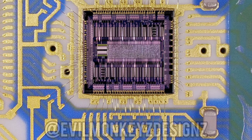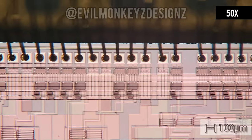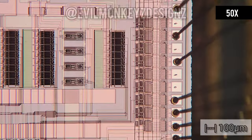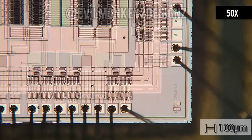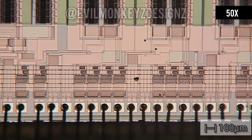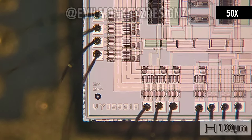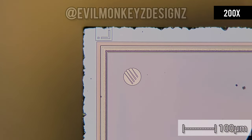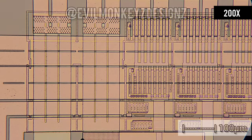This second chip appears to be made by VLSI and includes the text MUDAC in one of the corners. In the context of an integrated circuit, I think DAC refers to the fact that this is a digital to analog converter, with MU being the Greek letter mu — the common symbol for micro — or perhaps I'm reading too much into the name MUDAC. The part number VY05931A also doesn't give any clues as to what this part actually is. If you've got any ideas or can find additional information on it, definitely let me know.